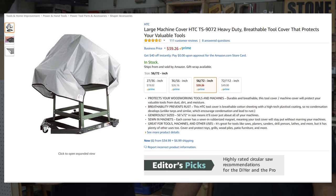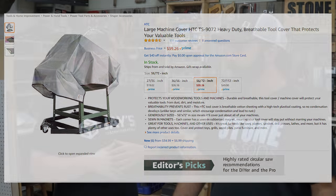Have you ever heard of a tool cover? Kind of like a grill cover. You don't necessarily want to use something like a tarp that is not breathable, because condensation will still form — the humidity will trap it and you're back to square one. They make specific tool covers that are breathable, like a cotton and poly blend. Think about a landscape fabric that blocks weeds but lets water through — that concept. It's like a one-way street. So you put it over your tools when you're not using them, and what that'll do is create a shield from those drastic changes, allowing the tool to reach equilibrium slower when you are in a heated environment.